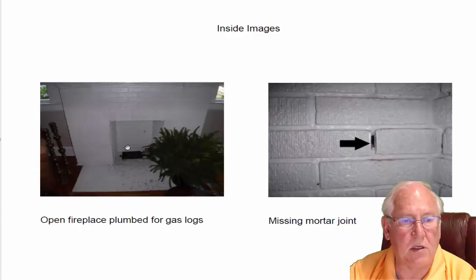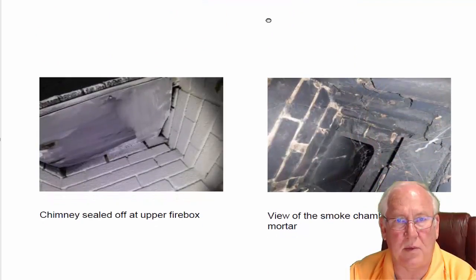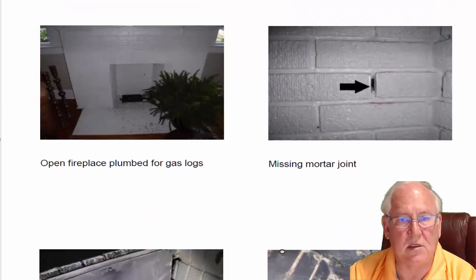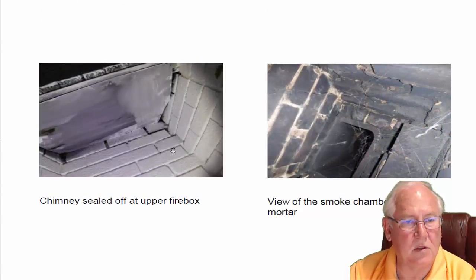So it's a freshly painted, open fireplace. It is missing one single joint here that should be filled with refractory cement, and then some white glossy paint right back over it. I'm giving you a price on filling it — I won't do the painting; the homeowner could do all of that themselves if they want. But in order to use that fireplace for vent-free gas logs, you're going to have to do that. The reason is, when you have gas logs installed, many times there are permits pulled and the county wants to come out and take a look at that, and everything has to be up to snuff.